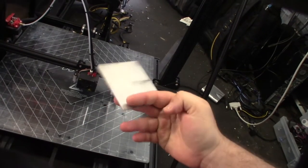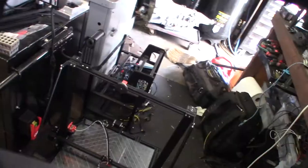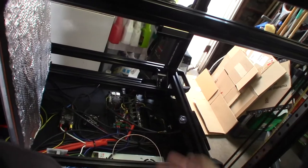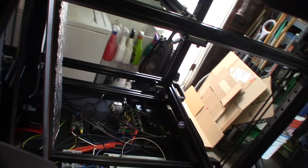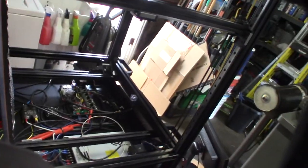The aluminum will help dissipate the heat. Here's another printer I'm working on too - this is a commercial version of the Voron. I'm actually making a video about this one next. It runs RepRap firmware but we're going to convert it to Marlin, because there's no support for this board and the drivers are burnt out - we're not getting any output on them.